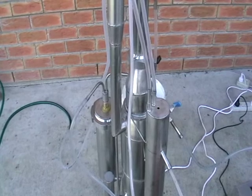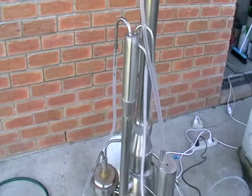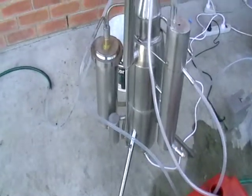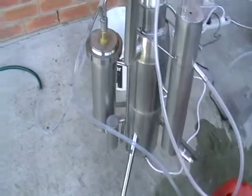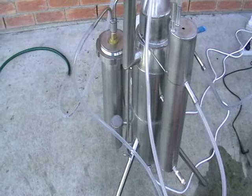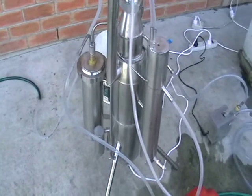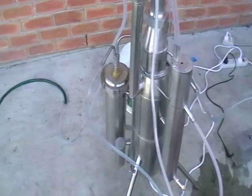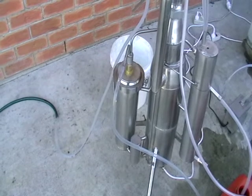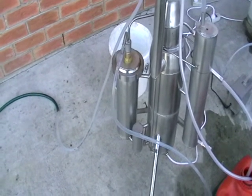The steam that generates over there is recondensed — it's a condenser, and it's a return tube. You can see it just going along the side. This tube goes back to the steam generator, so it's the same water all the time. The water distributor is compensating if any water evaporates, so it keeps the level constant.